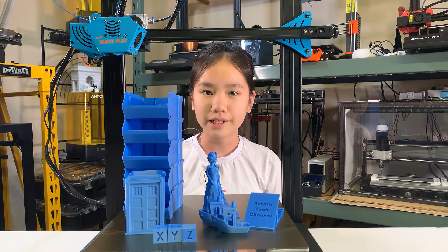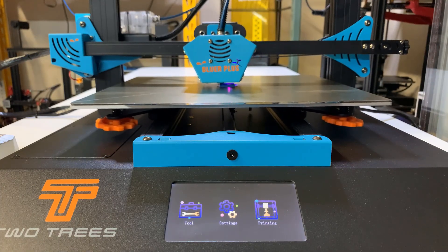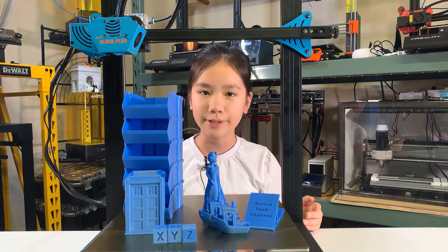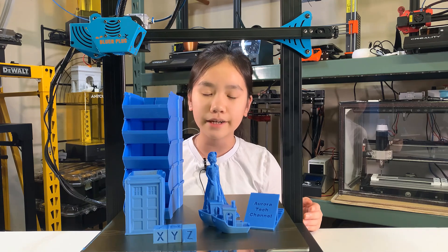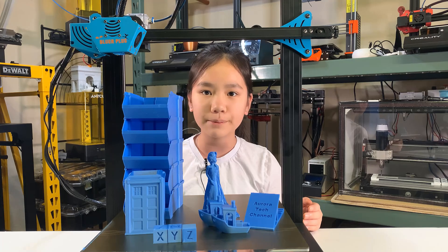But like most other budget 3D printers, this printer is not perfect. The only issue I could really find is the firmware — the modified Marlin firmware with graphical interface from MakerBase didn't work with G29 in the starting G-code. After auto bed leveling, it still prints normally, but you can't bring back the info screen during the entire print. I've printed all these models without using G29 to re-level the bed, as removing prints from this PEI spring steel sheet is easy — you don't need a spatula, unlike on a glass bed. The print bed won't move at all, so you may only need to re-level it once in a while.